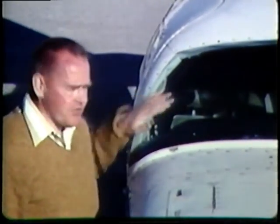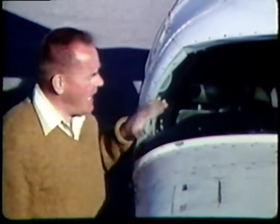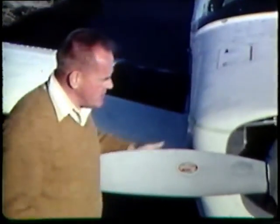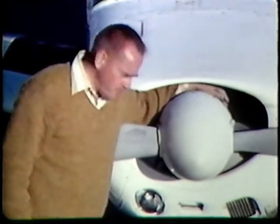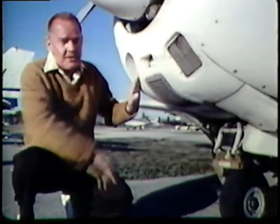It's very important to check the windshield for cracks damaged by weather such as hail, sandstorm, or blowing sand. Also check the cowl for damage by vandals — this opening should be clear. The propeller itself should be checked for damage, and the spinner should be checked for possible cracks around the screws. Make sure there are no bird nests or foreign objects in the engine cowling, and check the alternator belt, landing light, and various openings on the cowl.